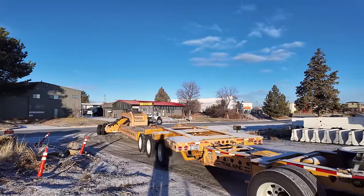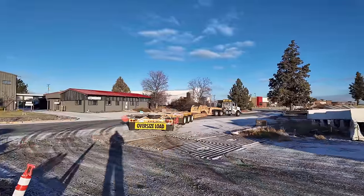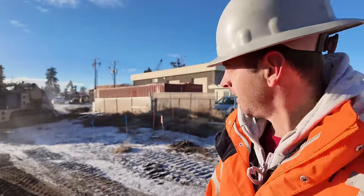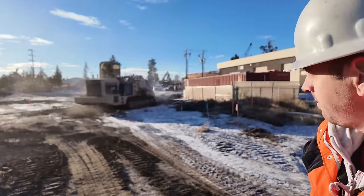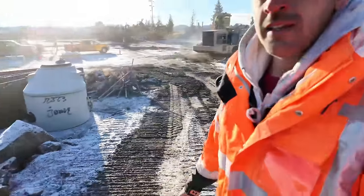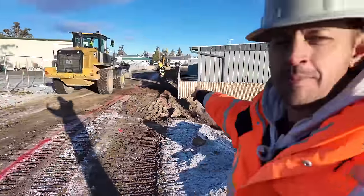Let's see if he wipes out the mailbox. It's almost like he knows what he's doing. They've got the trencher digging over here. We're in Central Oregon, which is basically one giant lava field, so everything around here is rock. We've got big rock saws like this — this is one of the biggest in the area, if not the biggest. Right now they're set up to go down 14 feet. They can go longer on that bar to go 18 feet by adding sections, and it will just saw through any bit of rock. They tie in the utilities from over here all the way down this right here — you can see the line where he's going to tie into the main utilities of the street over there.